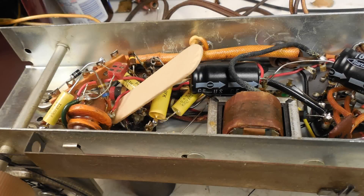I did find where to solder the leads for the new capacitors. What I'm doing is positioning the old terminals out of the way so they're not touching anything, and I've poured epoxy glue in there to make a plastic insulator. I'm using five-minute epoxy but I'll let it set for an hour — that ensures those two unused terminals won't touch anything and won't move.